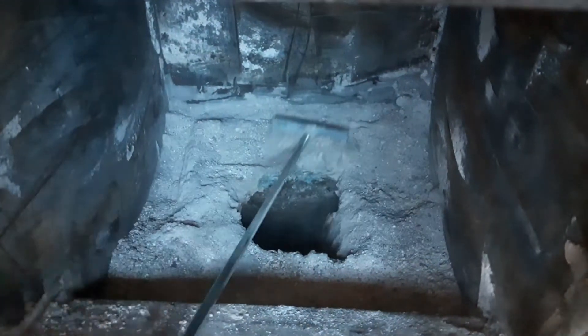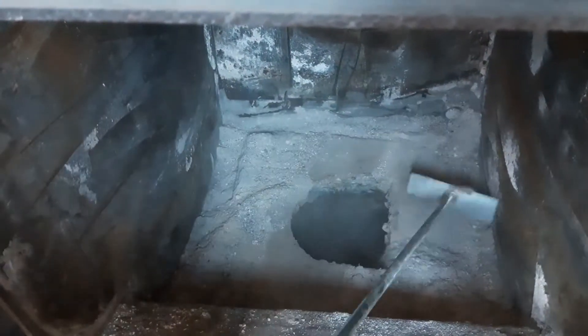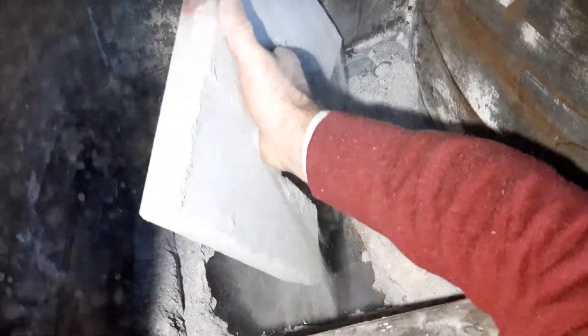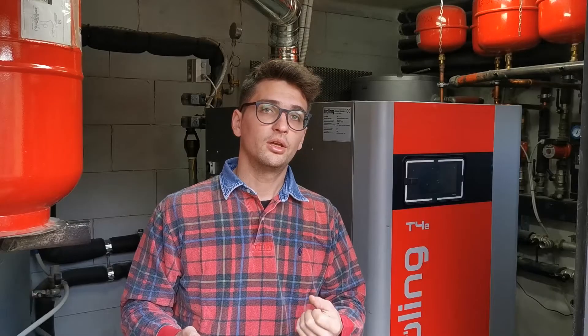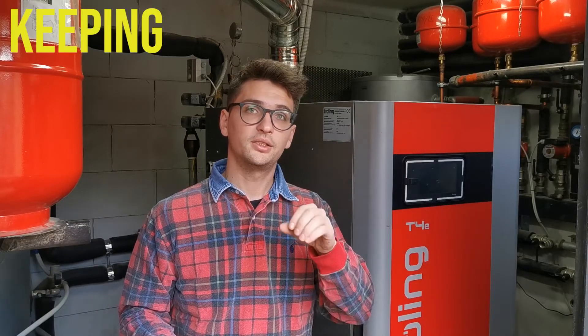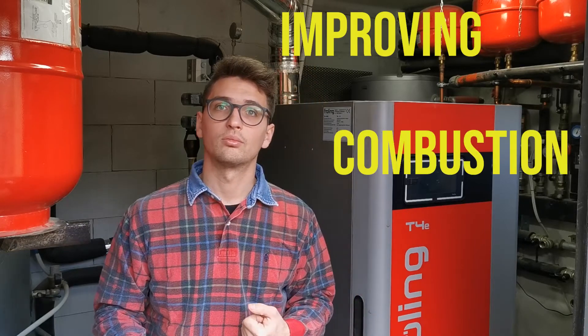At the end of the cleaning you can see, underneath the ashes, a plate made of refractory material. There is a big hole in the middle and it lets the fire pass from the combustion chamber up to the second volume. This plate plays a specific role: it keeps the combustion environment really protected and retains a lot of heat inside, so the combustion stage is really hot, improving efficiency significantly.